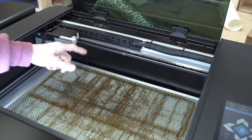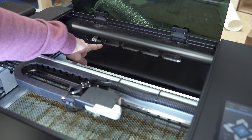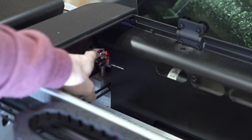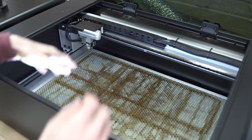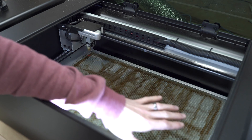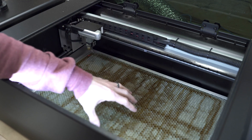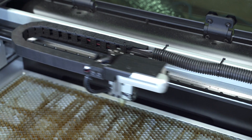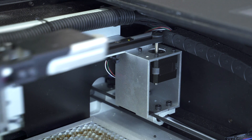This is the camera sensor with cameras right underneath, and here is the laser head. If I jog it forward you can see the actual laser tube — this is actually the 45-watt version, a slight upgrade over standard. You can see the red dot pointer bouncing through the mirrors and going straight down. It also comes with a removable honeycomb bottom, which is handy — it lets dust and cut pieces fall through and exit out the back. The X-axis runs on a linear rail using stepper motors.